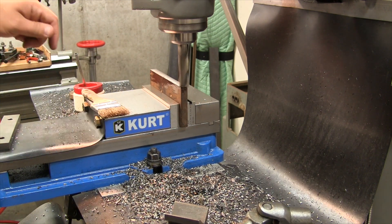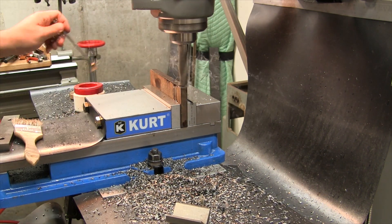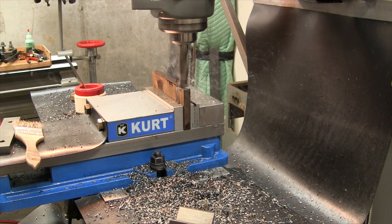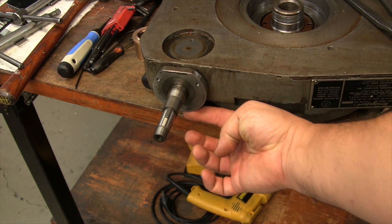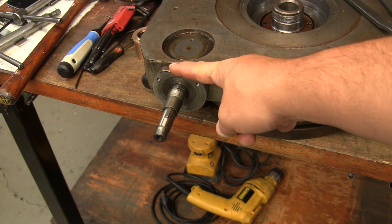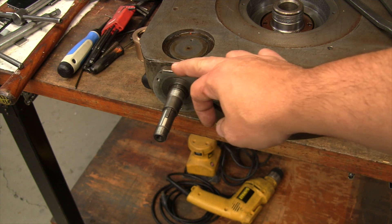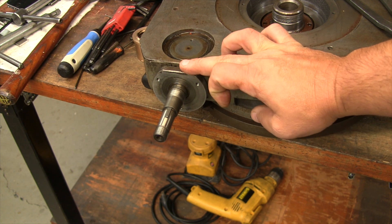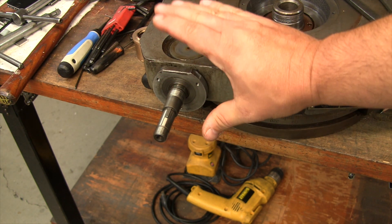Alright, that ends our milling. Now I measured from this round part to the flat here, and the measurement with the micrometer is 2 inches, 556 thousandths. I want this top flat edge to sit proud — right, above the edge here. This is going to be the edge of my piece of metal. I want this thing to sit proud by 2 thousandths. That will ensure that it is sticking up a little bit past and I can really bite down on it.